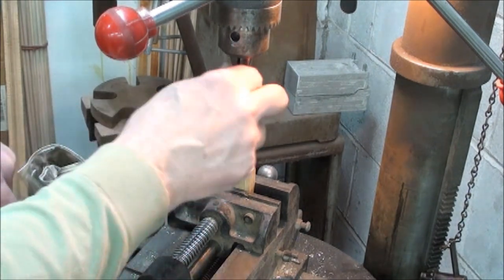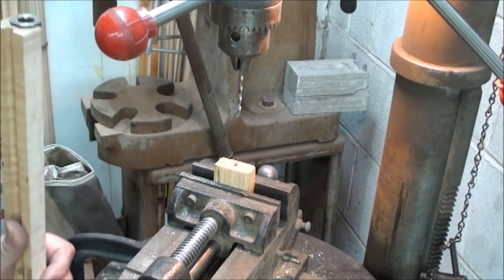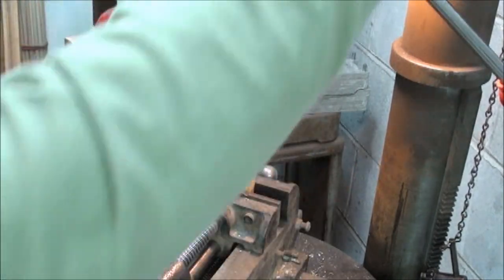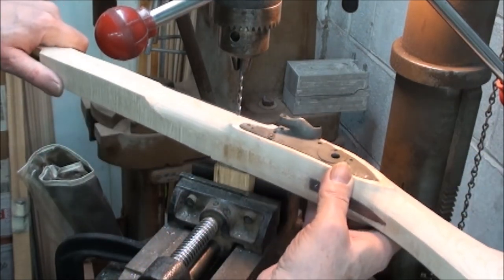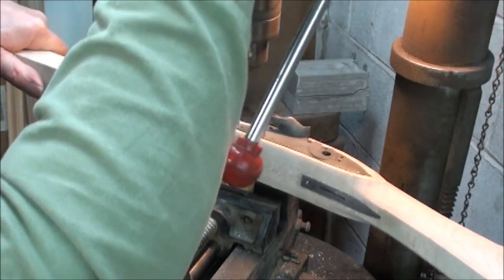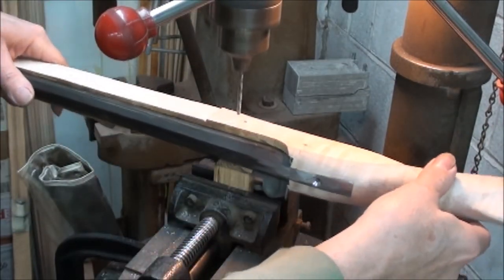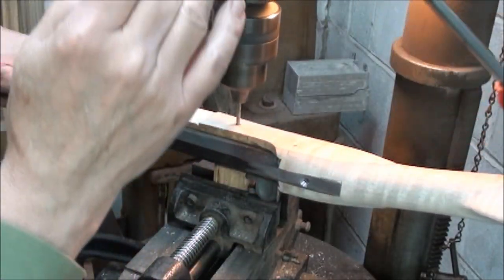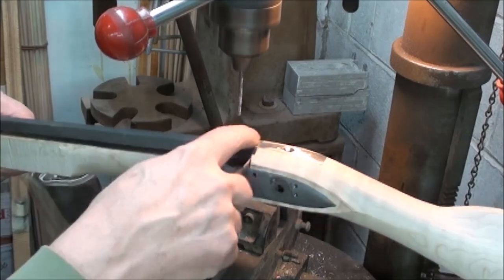What I've got is my drill bit set in a block of wood with a pin in it, about the size of the pilot hole I drilled in the wood. You can see I've got them set up point to point, everything locked down nice and tight. Since I've got the holes in the plate where I want them and I've got the spotted holes on the other side, I simply line that pin up on the hole and drill down from this side, then flip it around and finish drilling from the other side. Now that hole goes all the way through directly in line. Do the same thing on the back side.